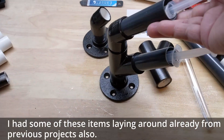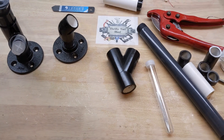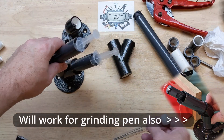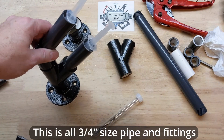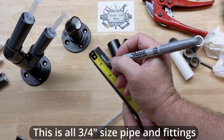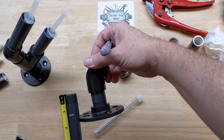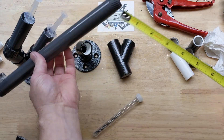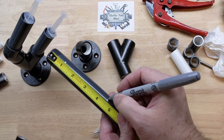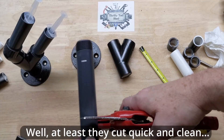This works for like Amtech 559 flux, as well as some others, and it'll even hold your low melt solder in the tube. We can make this several different ways. I'm just using this gray riser pipe — it's a sprinkler riser pipe. So here I'm just going to cut it, let's say around 1 and 1/4 inches, because I think this one was 1 and 3/4. That's about 3 and 1/4 for the holder tube. I'm just using these cheap ratchet cutters — they don't cut straight, but they do cut well.